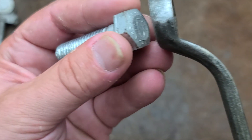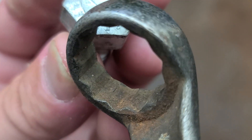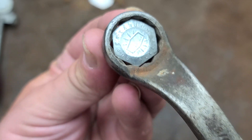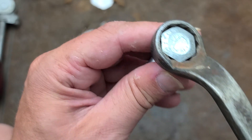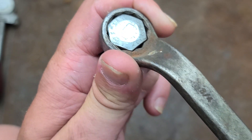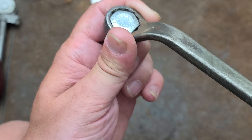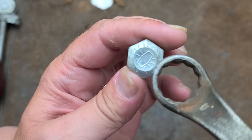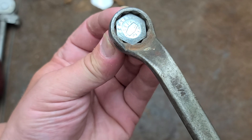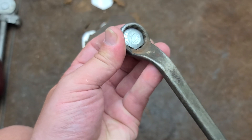On a lot of these old wrenches, even though they're not fluted, they did broach them pretty tight. They had good tolerances and really just didn't strip out fasteners quite as badly as a lot of people think. As much as I like flank drive and fluted sockets to drive on surfaces, when you have a quality wrench that isn't even fluted, it ends up doing the job nearly a hundred percent of the time anyway.